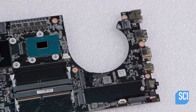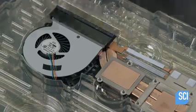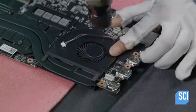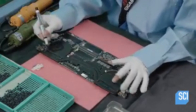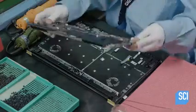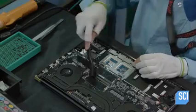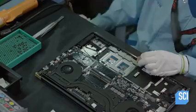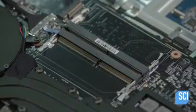After inspection, a computer-guided router cuts out openings to accommodate the computer's fans, which prevent the electronics from overheating. A gaming laptop generates a lot more heat than a regular laptop, and therefore requires two powerful fans rather than one. After checking that the fan screws are sufficiently tightened, they place the motherboard into the top cover. Contaminants such as dust or oil can impede proper contact, so as a precaution, they clean the connectors for the memory modules with solvent, then dry them with compressed air.